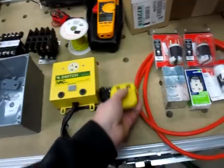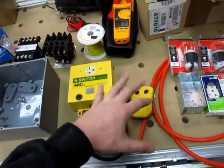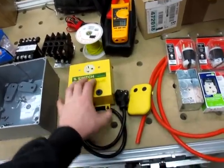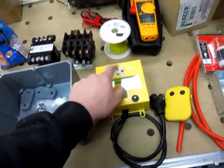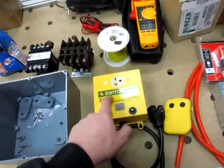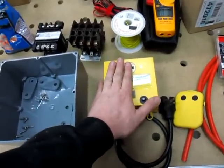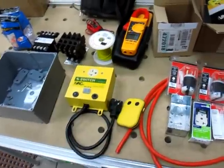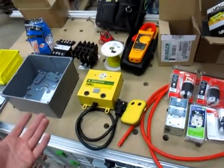This remote will run up to 8 of these switches and they're pretty nifty. They're kind of addressable where you can have one that will kick on a dust collector or multiple dust collectors or different tools. They also have a really cool deal where your tools plug into a box that, instead of being a switch, just detects the current draw from your tool and will turn on a switch like this. So if you've got a little 110 volt table saw, as soon as you turn it on it automatically will turn on your dust collector too, from up to 40 feet away.